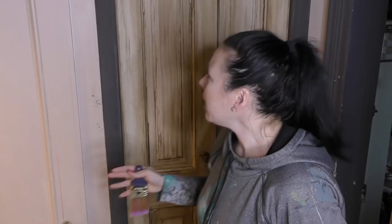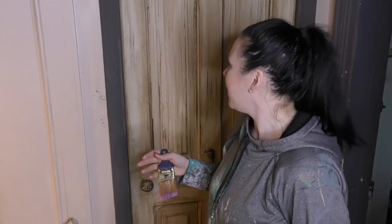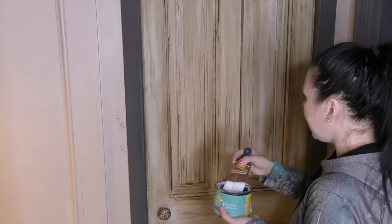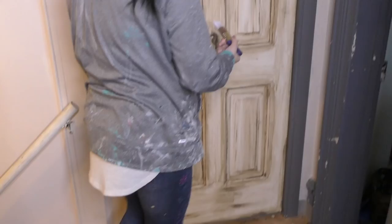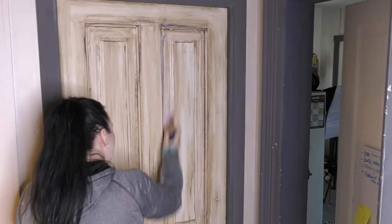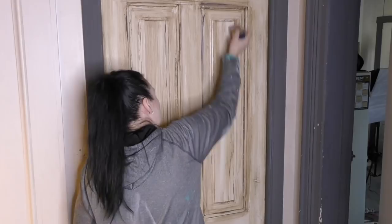You could have a plain white door smudged all over with fingerprints — or you could just make it shabby, old, and rustic and nobody's going to know the difference; it's going to look like it's supposed to be that way. I'm going to grab my Banana Peel — this is our clear coat, it dries clear. We need at least two coats to give it some nice all-over protection. You'll see it's off-white when you apply it — use that as your guide. Put on a nice light coat and move on to a new area; you never want to keep brushing over your poly or disturbing it once it starts to set up and dry.